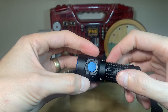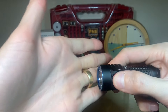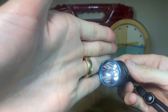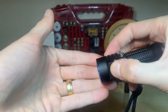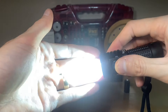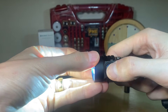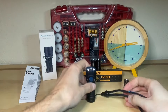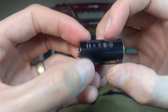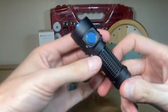Second thing to be aware of: you do get four of the five modes with the CR123A battery. You do get moonlight — if you want that, it still works, you can barely tell but it is on. You get low, medium, and high. But if you try to get to turbo — no turbo. That's probably because the max voltage on these is 3V as opposed to 3.6V. That's my guess anyway, but yeah, that's just something to be aware of as well.